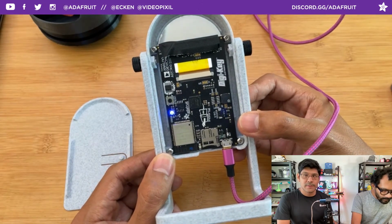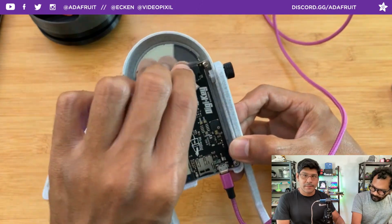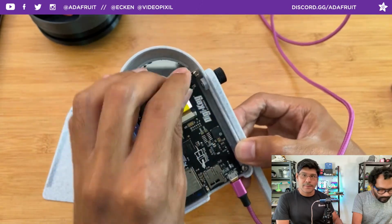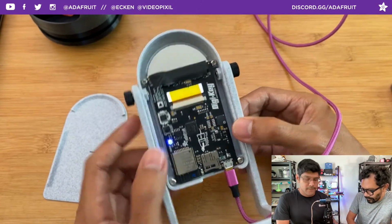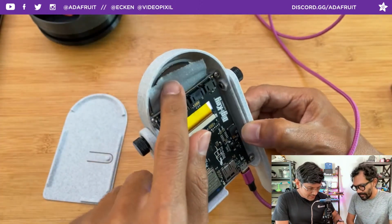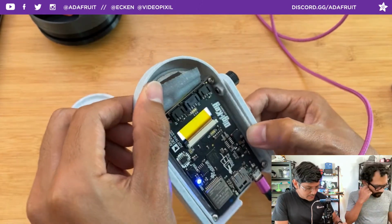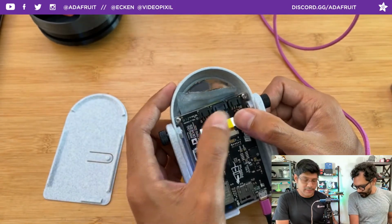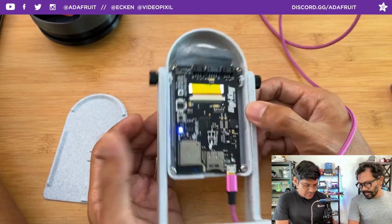There's also a built-in temperature sensor, and then of course you have all these ports here. Of course I have them covered up with gaffer's tape, but you could find a way to use those if you'd like. The ports are the STEMMA, the JST. There you go. Yeah, three of them. They're the bigger STEMMA, just so you know, but we have cables that convert them over. So you have two digital pins and then a STEMMA I2C port. Those are for adding additional sensors as well.